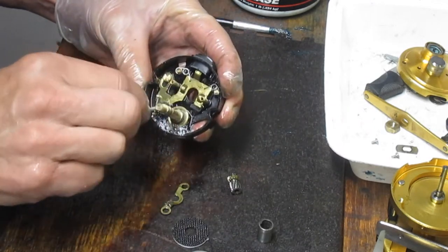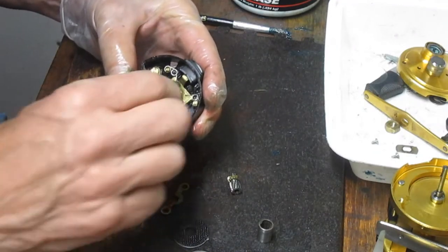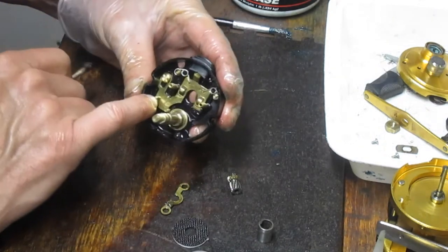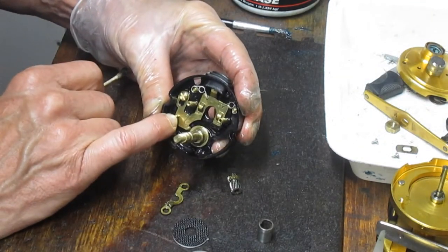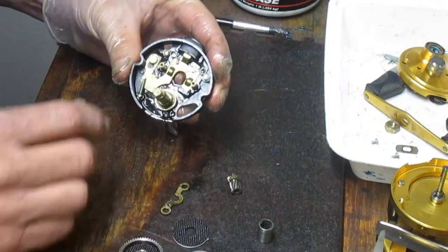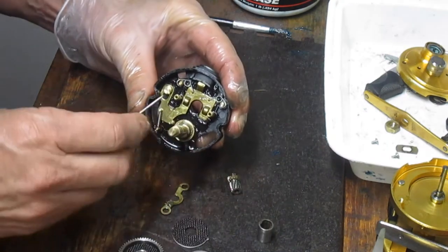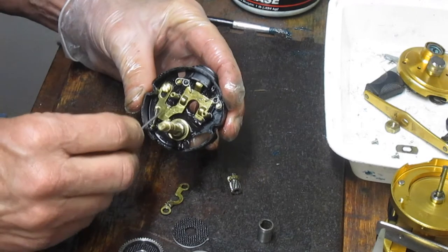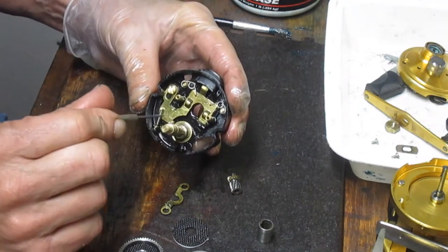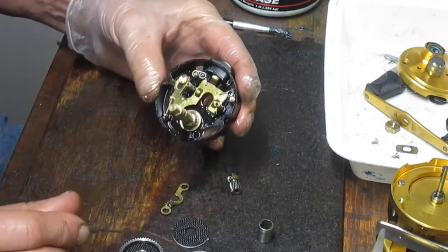If there's a broken part, certainly you want to take care of that. These pieces and parts are relatively easy to remove. For example, this is the trip lever that's going to be moved by the ratchet. If that broke, you would just take the screw out on the side plate, disconnect the spring, and remove it. This is only held on by those two springs, and a button for the release would come out as well. So if you have a sticky button, you can do that.